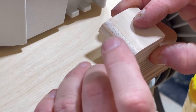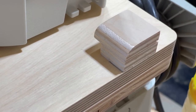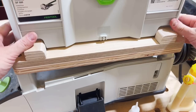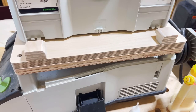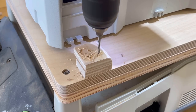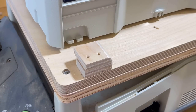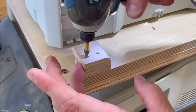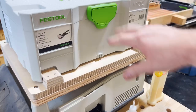You're thinking, wait a minute Chris — a lot of weight's going to be put on this, especially if you decide to pick these up. CA glue may or may not hold that entire strength. Well, you're probably right. So what I'm going to do is come back once I know that everything is nice and flush and reinforce everything with some wood screws. To reinforce this joint, we're going to drill down around an inch and a half with a relatively narrow drill bit. We're going to countersink these two holes. I get a lot of questions about what these screws are — you can find them in your local big box store. Home Depot sells a brand called GRK. These are the Power Pro variety — I got these from Lowe's. Go to your screw section and just look around.